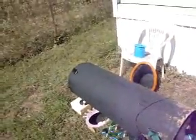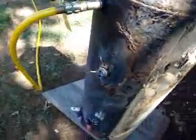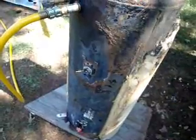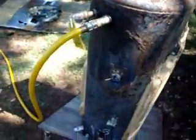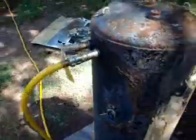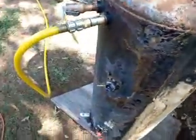This is looking real promising — I'm looking forward to getting this project finished and seeing what water temperature I can get. Here's the new tank I've gotten hold of; it actually came out of my house. When I started investigating this project, I looked into my water heater closet and found a small puddle at the bottom, so I had to replace it. I pulled this one out and learned my lesson from the first tank — I completely stripped it, painted it, and even got a pipe tap to re-tap the threads that were all rusted out. I got it cleaned up, pressurized it, and got a blowout along one of the seams.